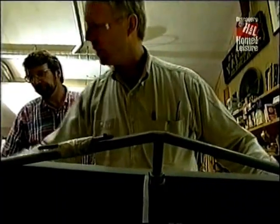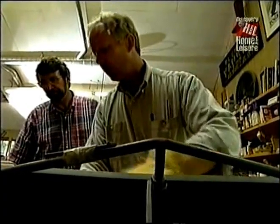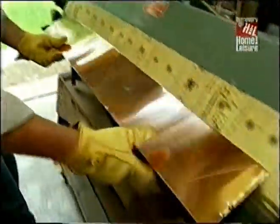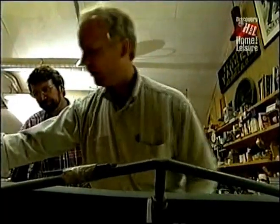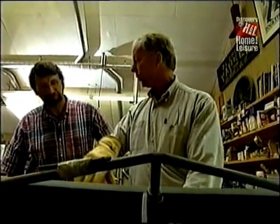I slide the material into the brake and align those cut marks with the top edge, the beam part of the brake. This first bend, I close tight. I call this a hemmed edge. So you've actually just folded it over on itself. That's correct. And here is a good example of why the marker would be less desirable as a marking instrument, because I have flipped the material over and my marks would now be on the underside.